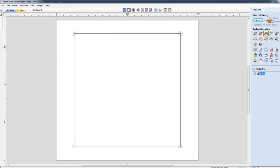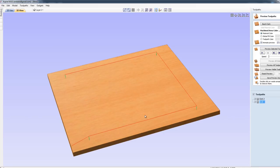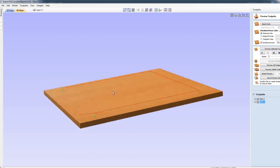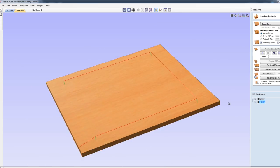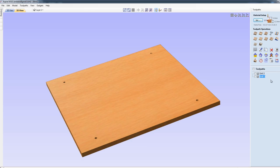The next stage is to select the drilling pattern. We can do various different things — this will allow us to set the cut in multiple passes. We're gonna do an 8 mil hole in 3 mil drill steps, so it cleans out the hole each time. Then we can calculate that and see the toolpath it takes. The red lines show movement above the piece, and the blue lines are the drills into the piece. We can preview that and step through it to see those holes actually being drilled. Then we can go and export our G-code for that particular machine.